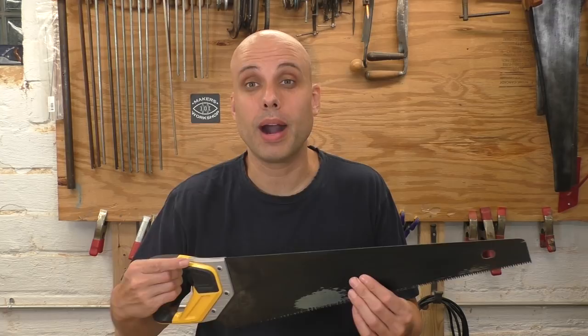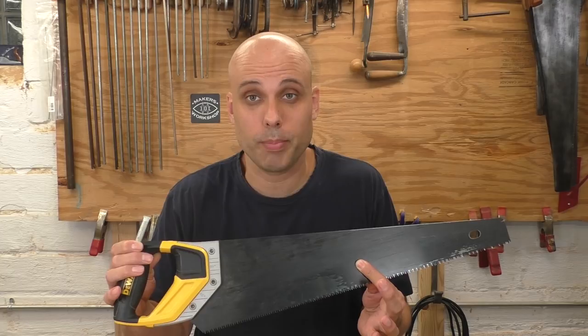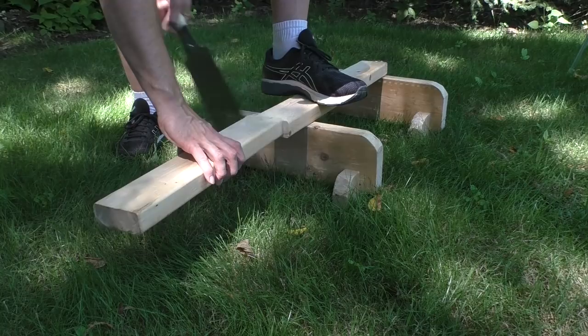If you're getting started in hand tool woodworking and want the most affordable set of saws right now, I would start by going down to the big box store and getting one of these inexpensive jobsite saws — they stay sharp for a long time, they're tough and strong, and they're really inexpensive. You're also going to need a saw for medium cuts and joinery — for that, it's really tough to beat the Ryoba. It's got rip and crosscut teeth, it flush cuts, leaves a nice surface, and even good ones aren't very expensive, especially when you consider you're only replacing the blade when it gets dull.